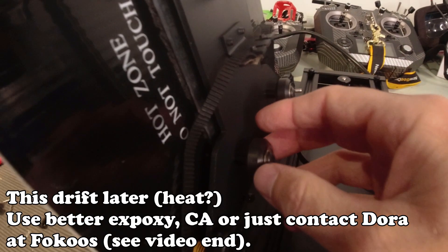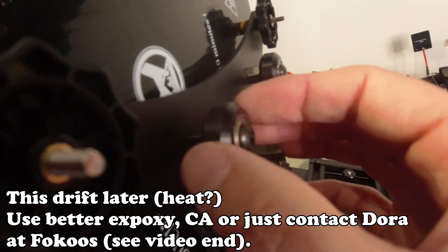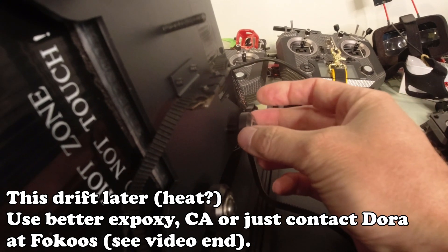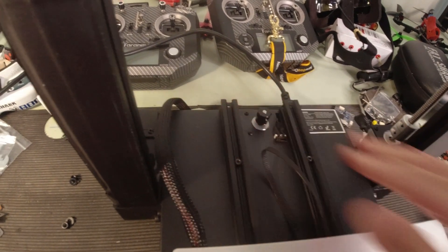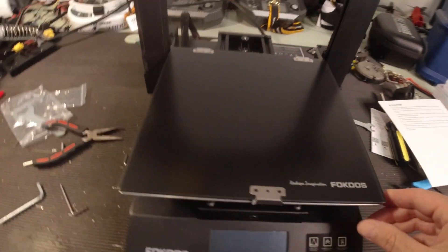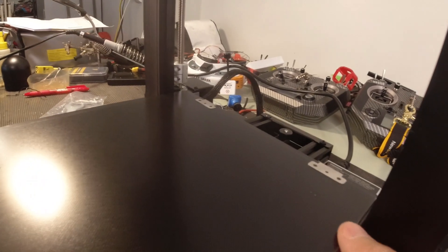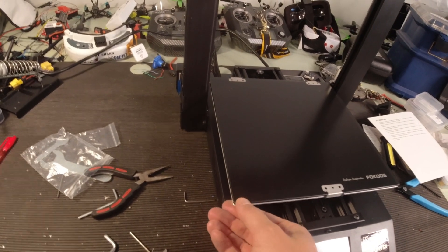What I did to fix up these rollers, which were loose as I talked about before, is I applied some epoxy inside the roller and then slipped it onto the bearings. If you're sliding it off, do it from the back, because in the back you have enough space to get it back onto the rails. Now the plates are on, and I tightened the screws down in here — that one and that one — so there's no wiggle on the plate, no wiggle back and forth, and no wiggle up and down anymore.